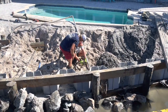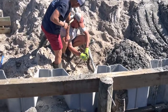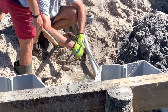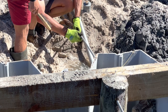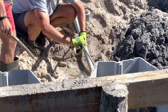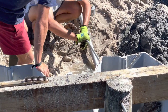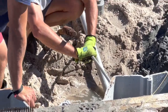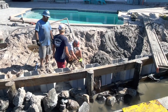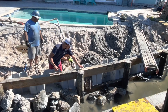We just got the manta ray anchor driven almost 16 feet behind the seawall. Now we're connecting a 6-foot rod to the 12-foot rod that started being buried, using a coupling nut. We'll tie that rod to it, drive a couple more feet, and there'll probably be about another foot sticking on the side of the wall. We'll hook up to that rod, pull on it, and lock the anchor. We're doing this because of the swimming pool — we can't put any pilings right there next to it, so we're driving these anchors up underneath the swimming pool to hold the seawall.